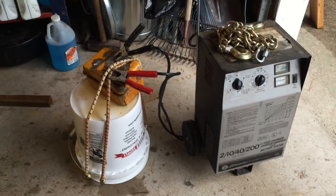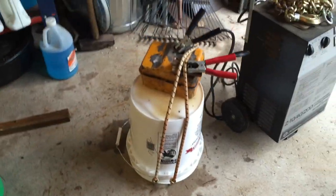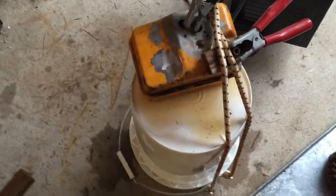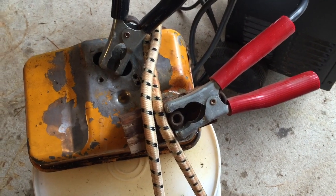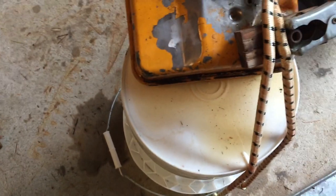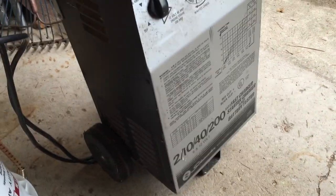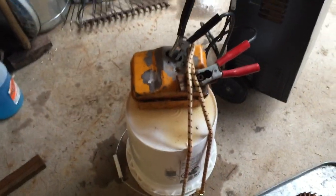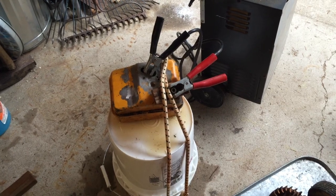Hey YouTube, I thought I'd remind you — when you do this, double-check your work once in a while. I came out about an hour after I'd set this up and it turns out this is a two bungee strap job, because I was doing a dead short between positive and negative. The board had tipped, so my sacrificial anode was touching my cathode. Because this is a 200-amp booster starter, it was just happily pumping two amps, slowly warming up the wires. Now we're a two bungee strap job, and in about 24 hours I'll check and see how it's coming along.